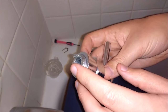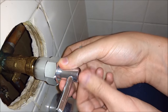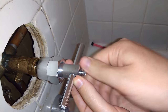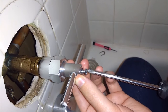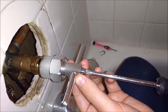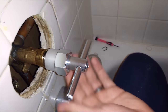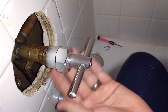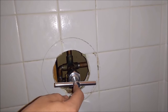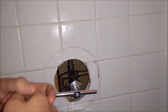You'll have these grooves here that will go on either side of the cartridge, and then you can just tighten that screw on it — it will go on the cartridge. I'll grab the Phillips here and tighten this on. Once that's on there, tighten this piece. We tightened our screw so it's turning inside the cartridge and the screw has caught the cartridge now.